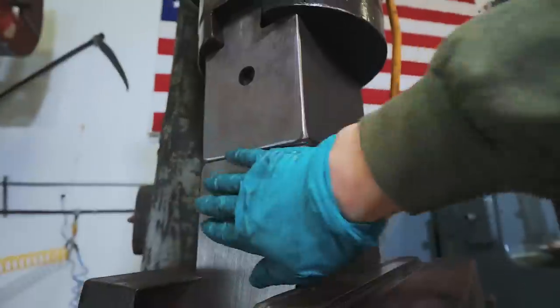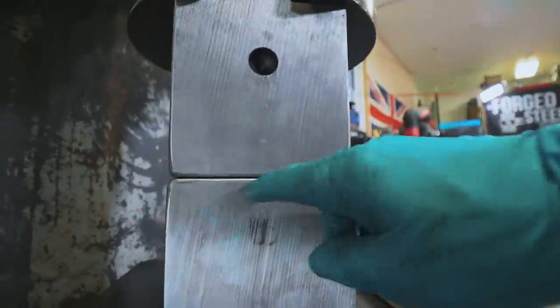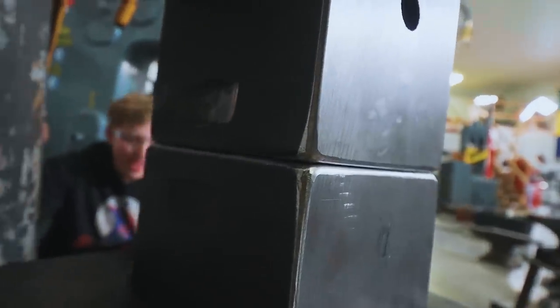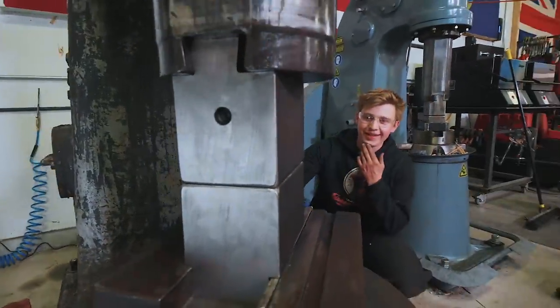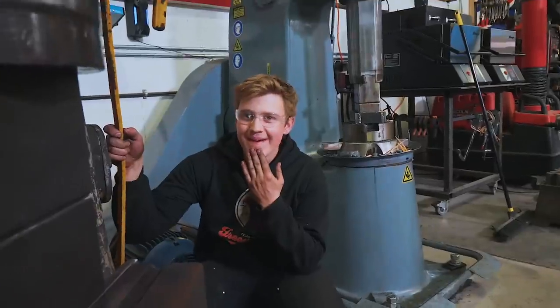Look at that — we got these dies cleaned up nicely. Those dies lined up just beautifully, not only side to side, but I can't see any daylight through it, which means we picked the right reference of square. We got it bang on — dead nuts. A little bit better than the Pilkington dies, which were out of square by a long shot. These here are perfect and they're ready for some hot steel.